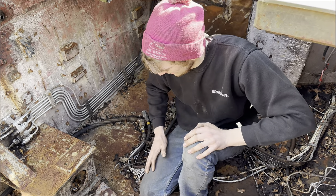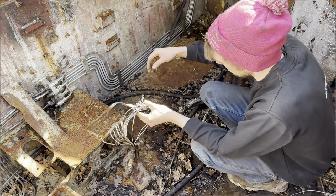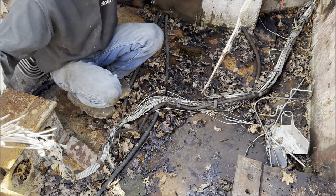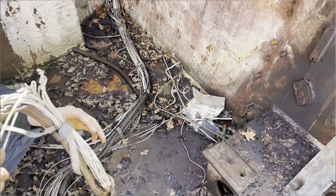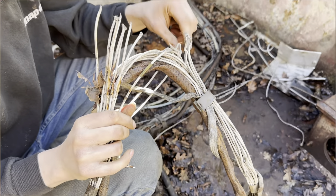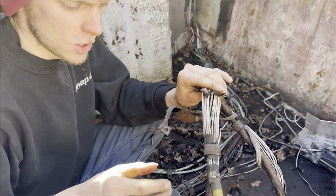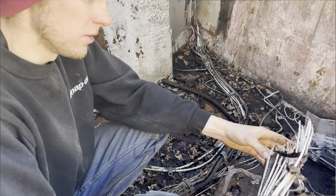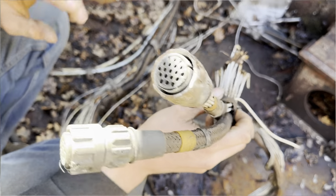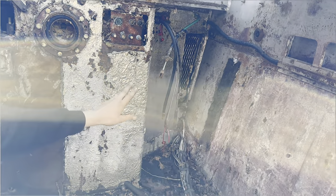The wiring has been jackhammered - all this wiring here goes to the gearbox, that went to the fan, and it goes up along there. Although it looks in a pretty poor state, believe it or not there are marks on the wires, so it'll just be a slow job going off the tags and soldering them back up. The plugs aren't actually that knackered, so that shouldn't be too hard to mend.